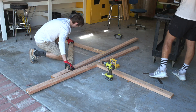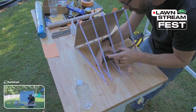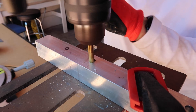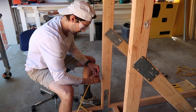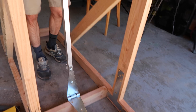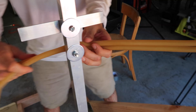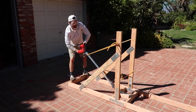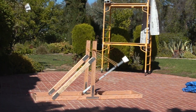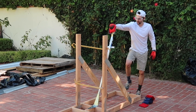The first step was figuring out how to build a catapult. This led us to the video from I Like to Build Stuff, who was coincidentally also on the Scott's Lawn Stream event before us. We followed Bob's build pretty closely, except we had to make some fabrications for cornhole — using a smaller handle to cut just the bag, a gate hinge instead of drilling a hole through the movable arm, and a one-half-inch rubber hose double laced to give us the power we needed. After our first day of building, we had a functioning catapult, but the cup wasn't the right angle. We disassembled the handle and bolted it directly to the movable arm, which gave us the forward-facing angle we needed.